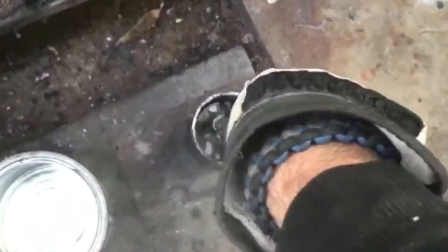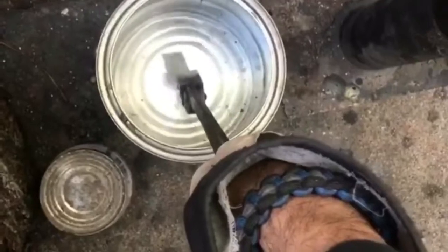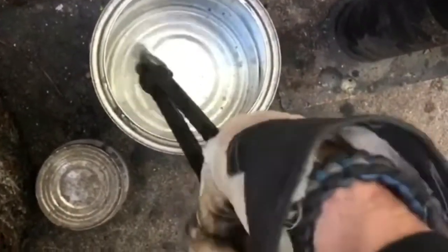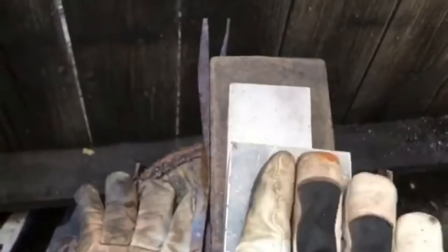Here's the air quench — non-magnetic, cooling off. And here's the water quench — non-magnetic, going in. For the air quench piece, I'm putting it down and placing my aluminum blocks on it, then cooling it off with the air compressor.